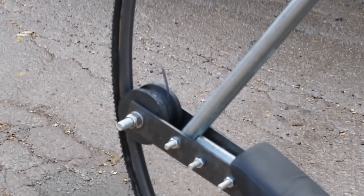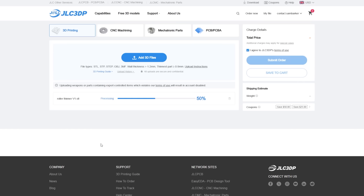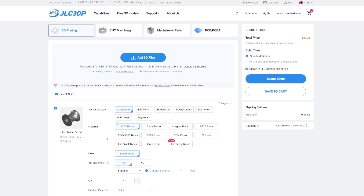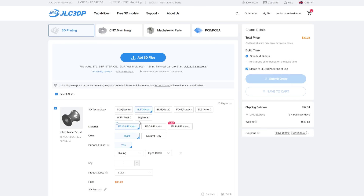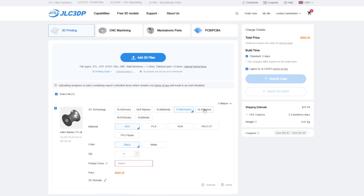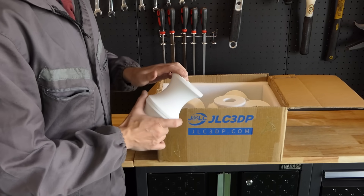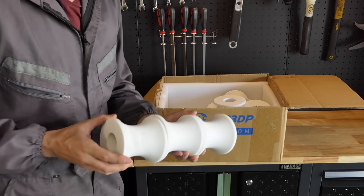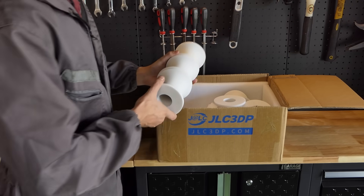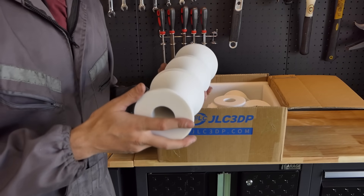For the monowheel I used PLA 3D printed rollers and they lasted about 10 minutes. For this I'm not going to make the same mistake twice. I designed them in Fusion 360 and then uploaded it to JLC3DP. This website is great — you upload your files and choose what you want them printed out of. They have over 20 different materials including nylon and metal, with a 48 hour lead time door to door. A few days later these nylon SLS printed rollers ended up on my doorstep. I really liked the instant quoting and being able to track progress. There are coupons from 30 cents up to $70 for new users — check the description below.